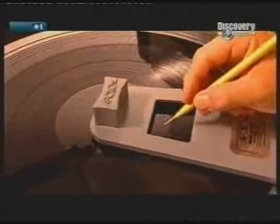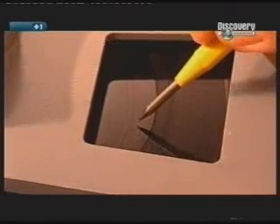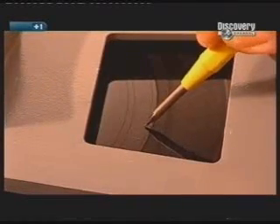If it's acceptable, the engineer places a stabilising platform on it and scribes a unique serial number into the lacquer. Soon this master disc will be making a big impression. The master disc has just been cut, but the lacquer surface is far too delicate to play. It's been produced solely to act as a mould. It will literally be pressed into service to make tougher versions of the recorded grooves, enabling manufacturers to make many copies from just one.